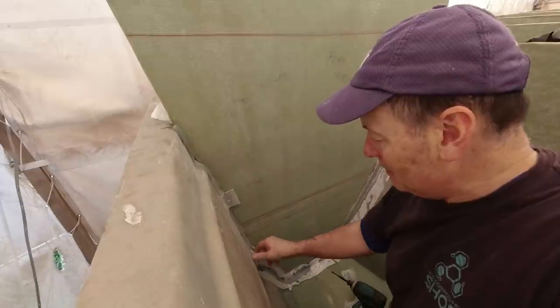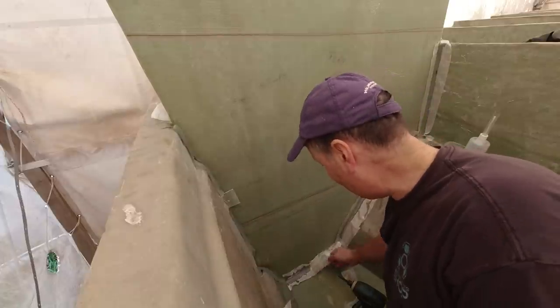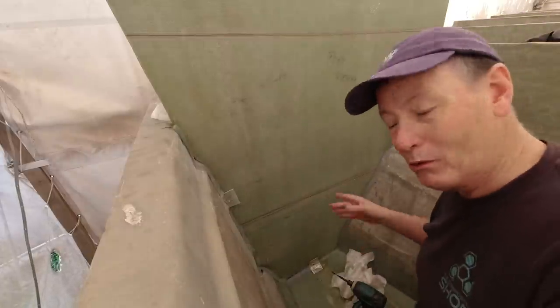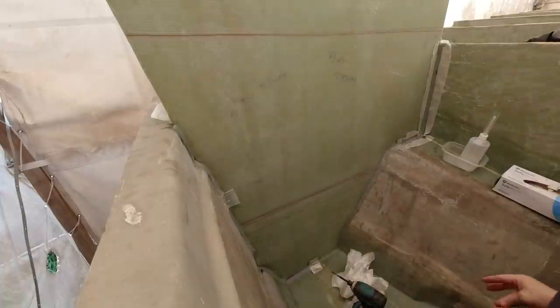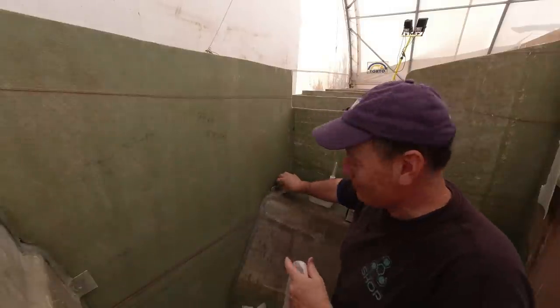Time to do this side — this has actually set up so I can remove the peel ply and my cleats, and then I'm going to have to give it a bit of a sand because it's a bit ragged. The peel ply certainly helps to settle it down — just need a little bit of a rough sand. That was only two hours ago. If I had an extra worker here it would have both been done, but I don't want anyone working in here with me. The other side's tabbed in — these cleats can come out, hopefully they'll come off, they usually need a bit of a pry.